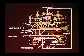When the clutch pedal is fully released, the spool is positioned completely to the right, and the modulator valve no longer has a pressure regulating function on the oil being supplied to the C2 clutch. The oil flows in each power selection are now complete, except for the operation of the retard valves during the shift process.